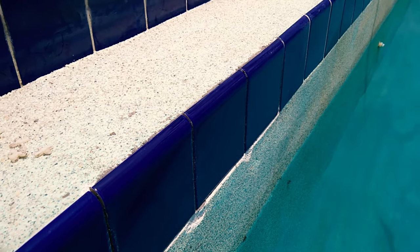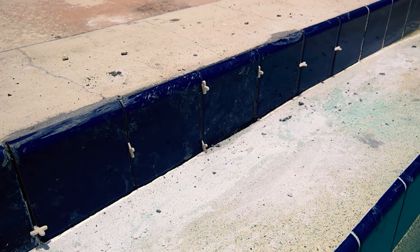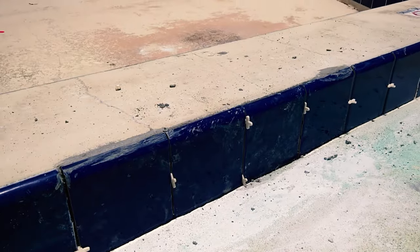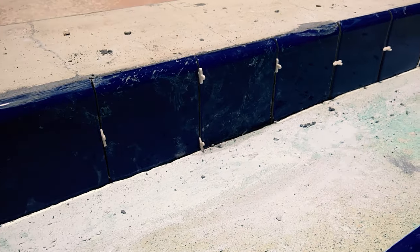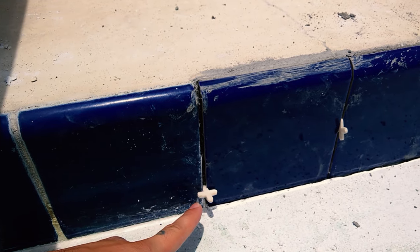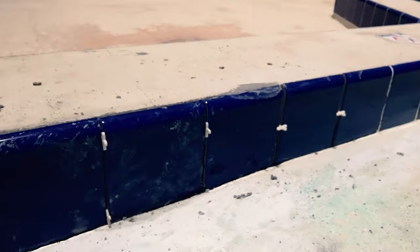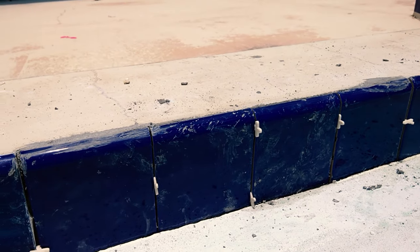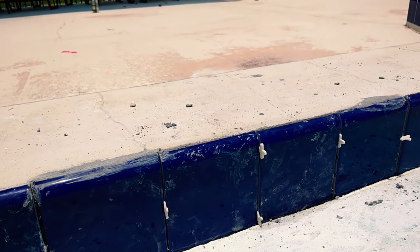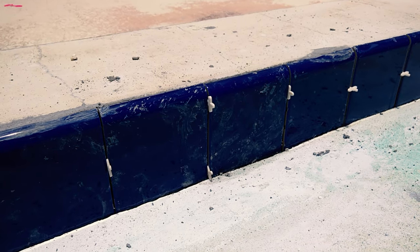Here's another spot — I did about four tiles here, wiped with the sponge, and in about another hour or two I can grout. They're even and they blend in nicely with the surrounding tiles. Sometimes when you're removing tiles a neighboring tile may chip — it's normal, just do your best to avoid it. The spacers help keep the right space between tiles for a consistent grout line.